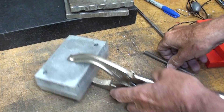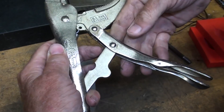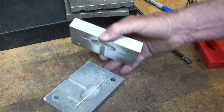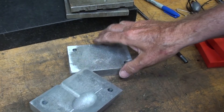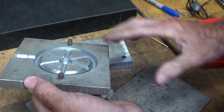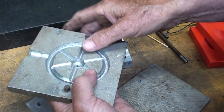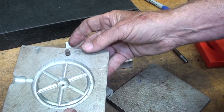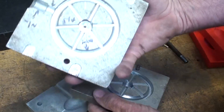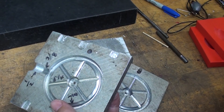Alright, they're reamed five-sixteenths. This is five-sixteenths rod — I can separate them. I went all the way through because I tried to avoid blind holes. But looking back at one of my other molds, that's only quarter-inch pins. What happens sometimes when I'm pouring lead in these — everything's so hot you can't touch it and you're banging it around — sometimes these come loose. So what I'm going to do this time is drill little holes and put a set screw in there so they can't move. Also, these don't need to be that long. I'll be putting these notches in, and the purpose is to help me later on to pry the two halves apart if they don't come apart readily.